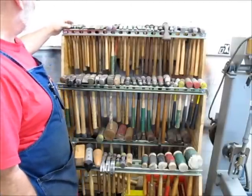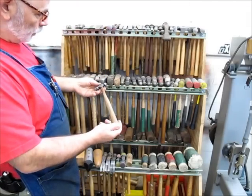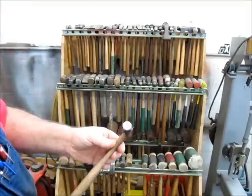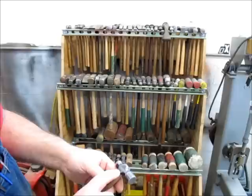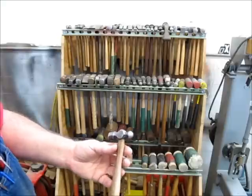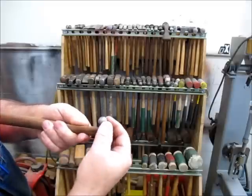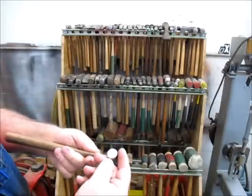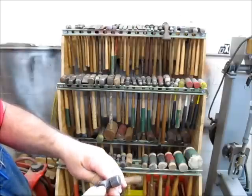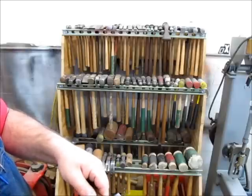Okay, these are just kind of straight ball peens, but let me pull one out just for illustrative purposes. So this is a little Stanley. This is a nice little one here. It's got somebody's name on it, Ruska. It's nicely proportioned, and what I look for in a ball peen is a well-formed spherical peen end, and no chips. If it's got a stock handle, that's great, that's still solid. So this is a nice little hammer.